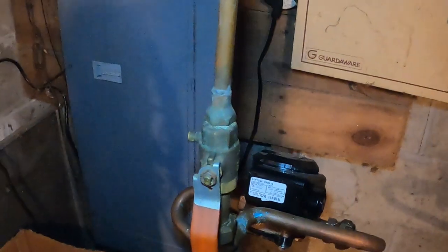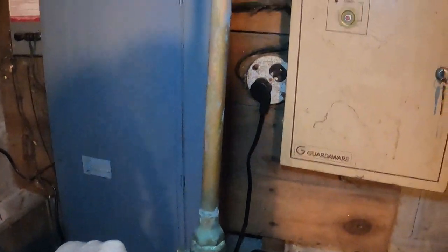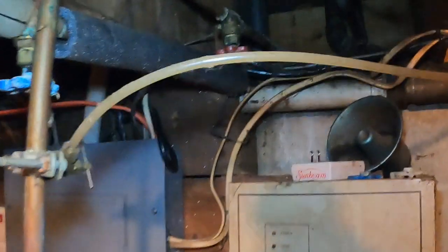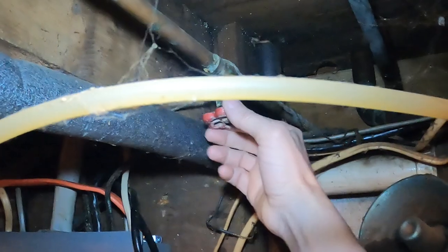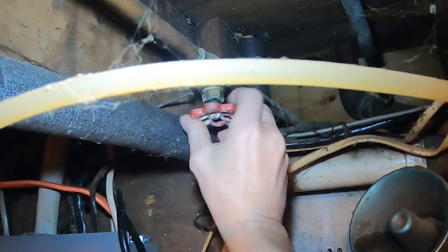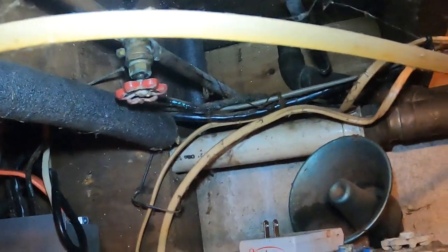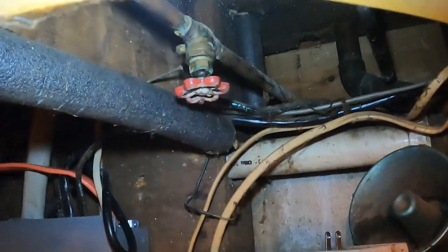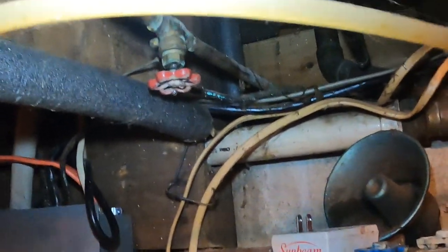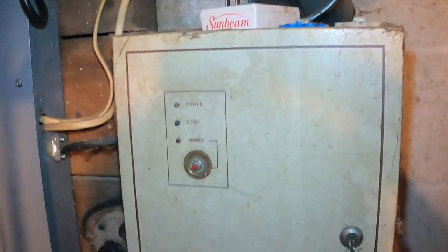So the first thing you're going to want to do is make sure you got your main valve shut off. What I'm going to do up here is open this - that means it's going to leak a little bit. Now you also should make sure you open the lowest point valve so the water all drains out. You're going to have water drip out of this once you cut through, so you want to make sure that you do have a bucket of some sort beneath to catch water that drips.